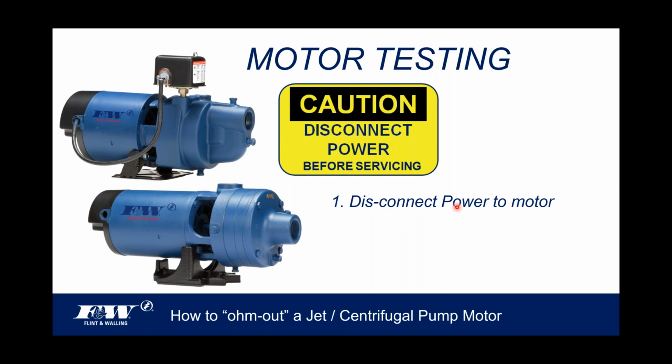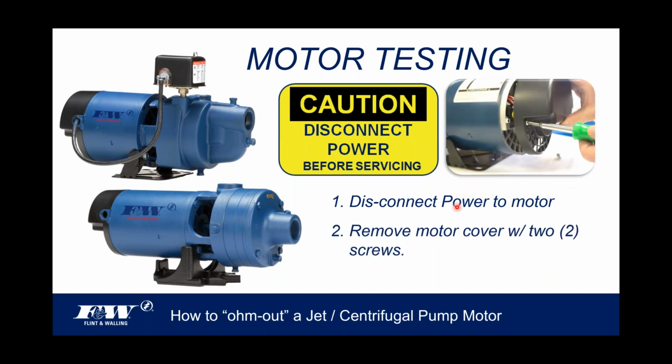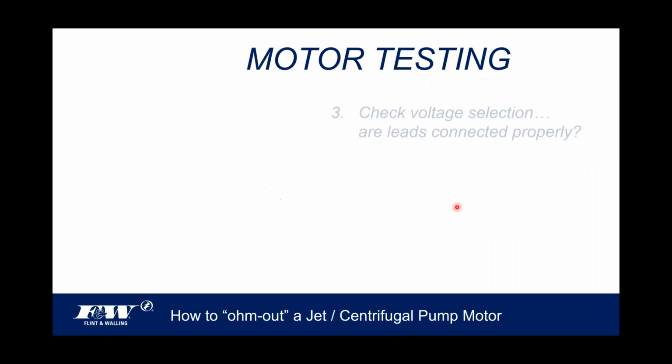But obviously, when we're going to be determining the health and welfare of a centrifugal or a jet motor, the first thing we're going to want to do is disconnect the power to the motor. And then the second thing we'll do is we're going to remove those motor screws in the back. That's the same place where we were switching the voltage in earlier slides. But we're going to take those two screws out, and we're going to remove that back motor cover.